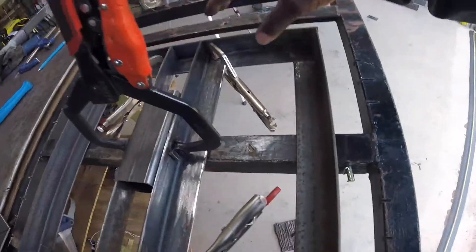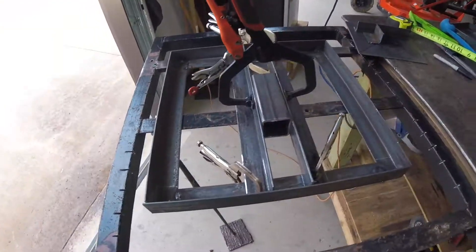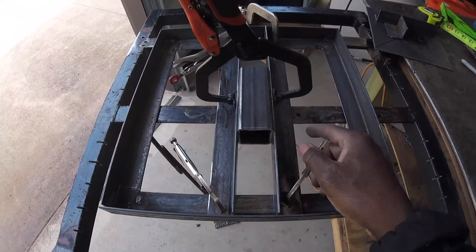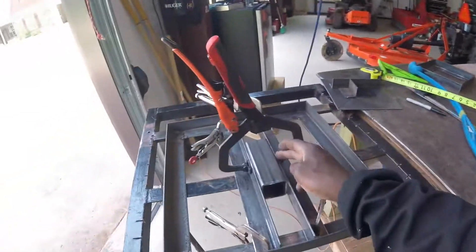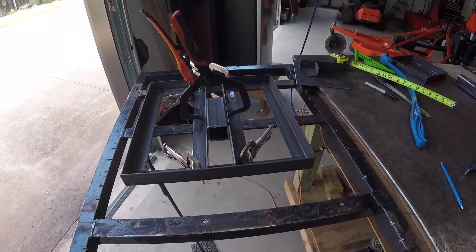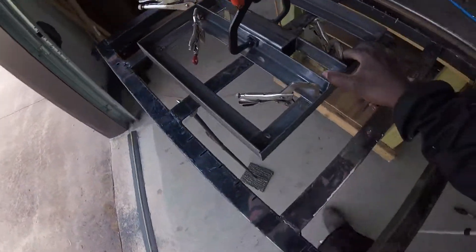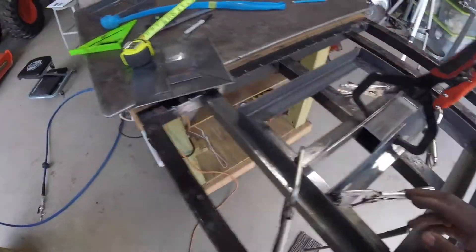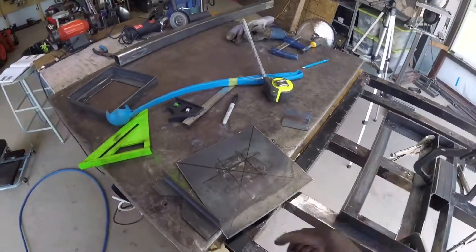Finally got the pieces clean on the base. These will be the two rails running across — the two angle iron rails come across the middle, 16 across, and this thing here is right at 8, so put an inch on this side, inch on that side. When we put the stem in we'll run a bead here, run a bead there, then flip it over on the back side and run a bead on the bottom. Got this all clamped up, it's ready to be welded. We'll tack it in the four areas and then come back and finish it out.